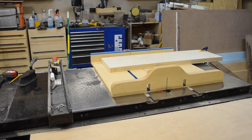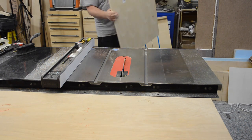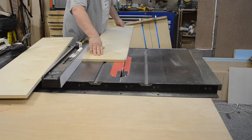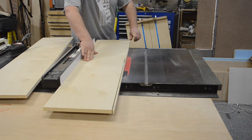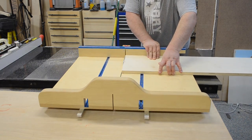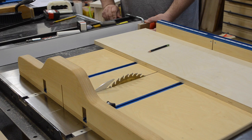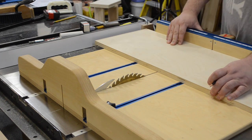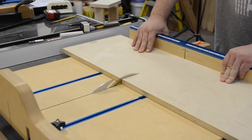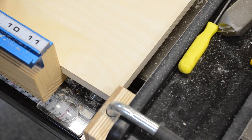For the sides and also the middle dividers, they were all the same size. I was gonna need five of those pieces, so I repeated the exact same process — ripped it to approximately half, slid the fence over to my final dimension, then ripped the opposite edge of both pieces, making sure I had nice smooth parallel edges. Same thing on the table saw sled: cut those ends nice and square. Then I installed a stop block on my rip fence to act as a stop since I had to cut five identical pieces. You can slide the piece against that stop block and then make your cut — that way you're not ending up with a piece that could bind between your blade and your rip fence.